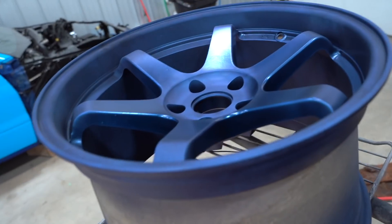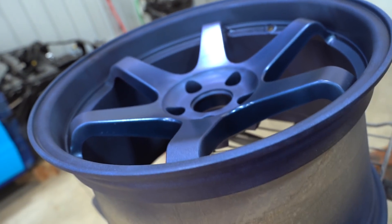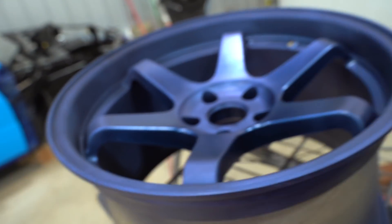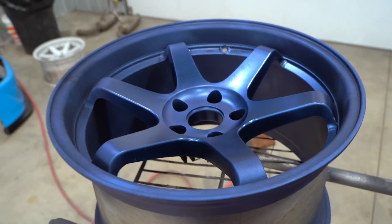The first wheel is sprayed out. The color looks a little blotchy, but I'm pretty sure it's because the wheel is still a little bit warm — fluidizing on some parts and not others. I'm hoping that as soon as it goes in the oven it'll all flow out and look beautiful. Both these powders cure at 400 degrees for 10 minutes. We'll throw it in, get the wheel up to 400 degrees on the infrared, start the timer for 10 minutes, pull it out, and hopefully it's the color we're after.